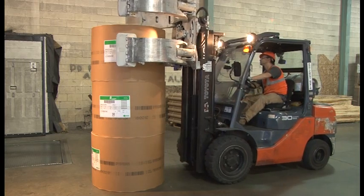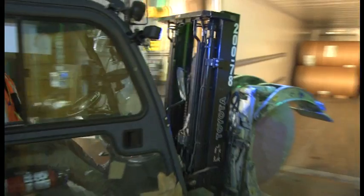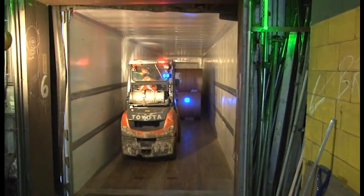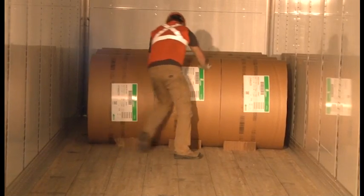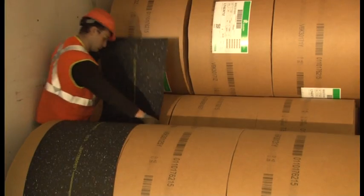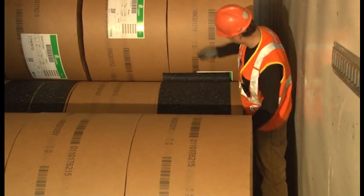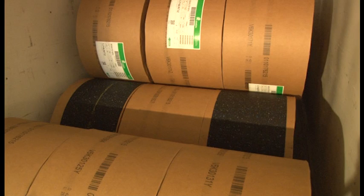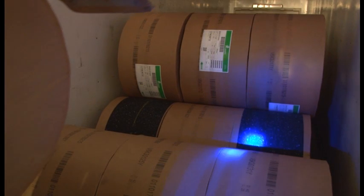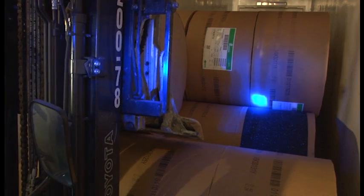Pick up the rolls with an eye as to where you will be placing them. Ensure rolls are straight and level in the clamps when you transport them. Allow room between the lift truck and the wall of the van for roll placement. Always remember to rest the clamps on the ground when you exit the clamp truck. Check each row of rolls as they are loaded to ensure they are nice and tight. Where the second tier is required, rubber matting must be placed on the bottom tier rolls on the outside edges of where the second tier rolls will be positioned. The mat must be placed on only the face of the back bottom roll so the top roll drops down easily and quickly when the front bottom roll is removed at its destination. Each second tier roll will need the outside rolls on each side of its supporting rows to have a single rubber mat placed on the face of the back roll.